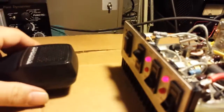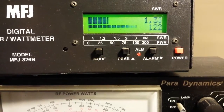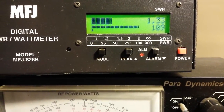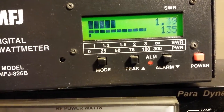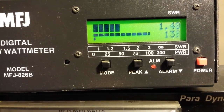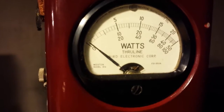Power supply is on 13.8 volts. We are on low settings — the middle is low, the bottom is medium, and the other way is high. Turn the box back on. On low, we're doing about 110 to 115 watts. Putting it on medium — about 150 watts on medium.